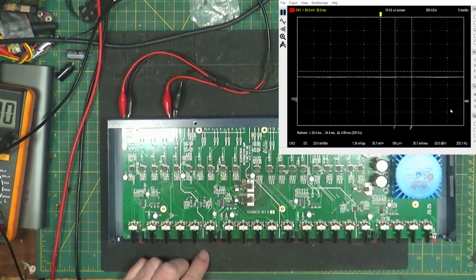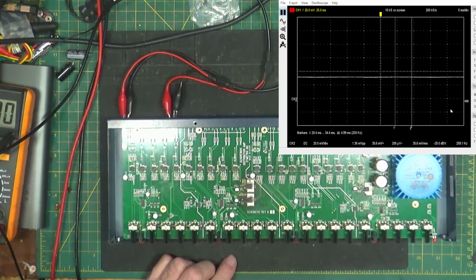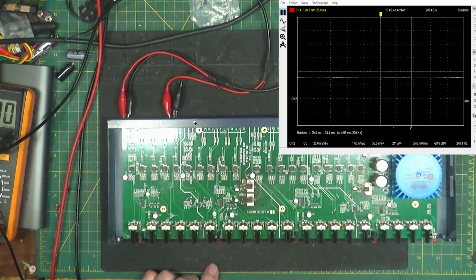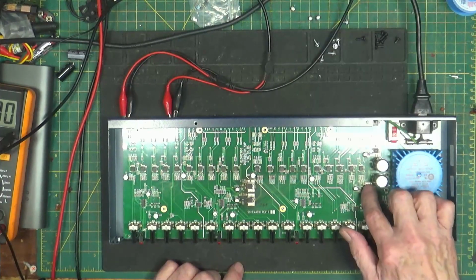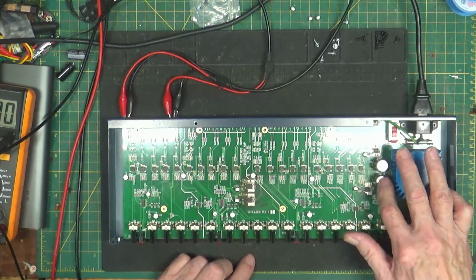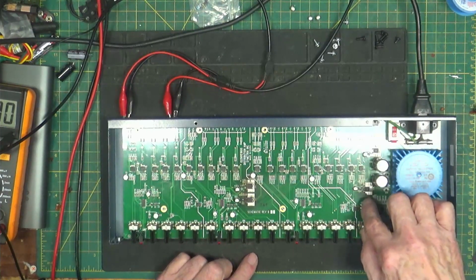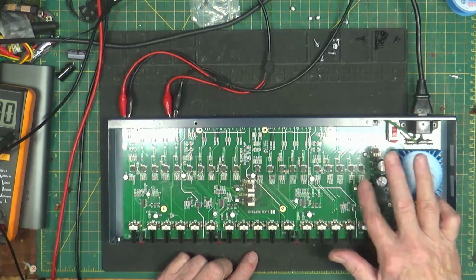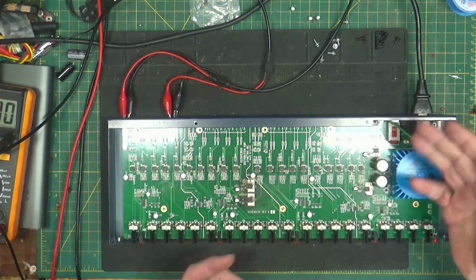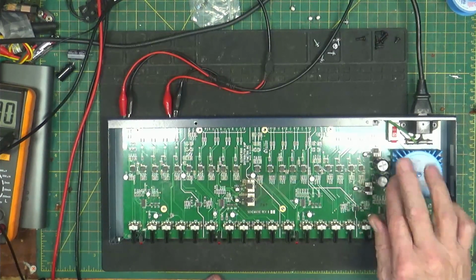It'll be awful. And you can recognize that if you look at the inputs and the outputs as far as ripple goes. The ripple on the output. These things are extraordinarily good at getting rid of all kinds of noise, just basic noise. Like you saw here, you had 800 millivolts, about almost a volt input, but the output was nothing. It was dead clean. These things are really good at getting rid of a little bit of ripple on the input. On the output from something that's coming in. So there you go. That's how you can tell if you've got bad filter caps.